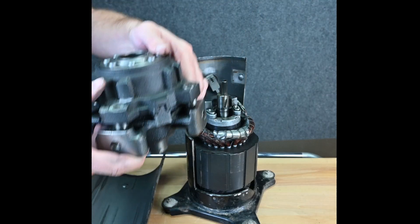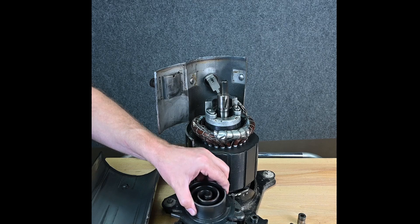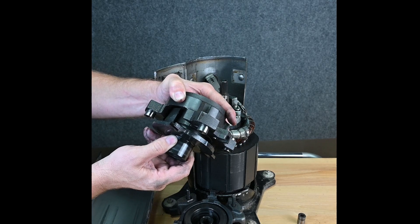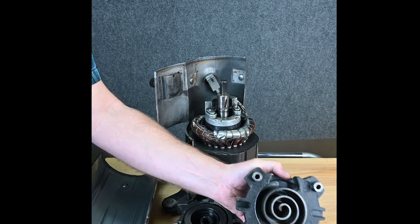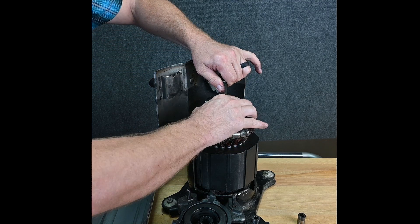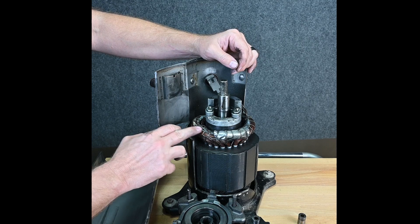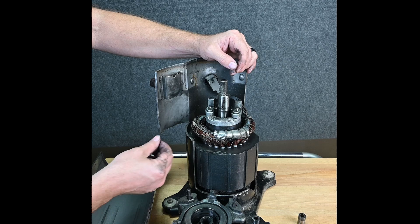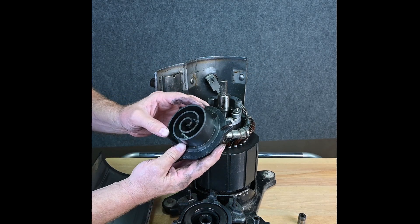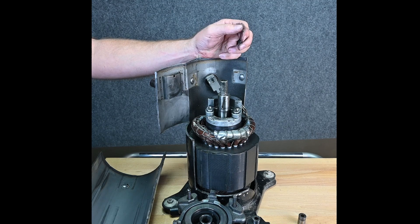If we take the whole entire head off, this is our whole pump action. You can see here there's a piece that's offset, and this is our scroll set. We have our plug that connects the motor to the back side of the casing, and we have our rotor — this is what rotates. It's got these little grooves in here with drill holes, and I'm pretty sure that's for oil circulation. This motor looked like it was in actually pretty good shape — the windings look like they're in pretty good shape. This is our internal thermal overload. All the scroll pieces look like they're in good shape too. I don't see any major damage, I don't see any copper plating. I don't know why this compressor was replaced, but we were able to take it apart and see the basics of how it works.